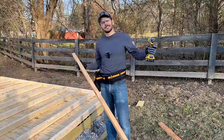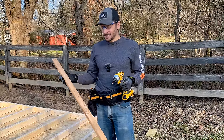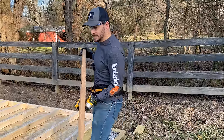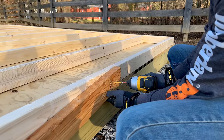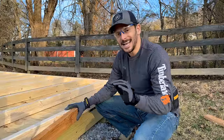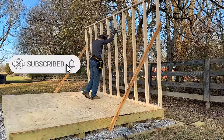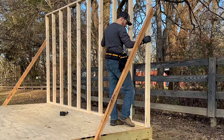I'm going to stand up the back wall now. Since I'm by myself — my lovely wife Susan is filming — I'll show you how you can do this alone. You can use a little helper beam: lay it out here and screw it into the side so this little screw acts as a hinge. When you raise the wall up, this little arm comes up and helps support it, and then you can attach the wall onto the foundation. There we go — I'm just going to square this up on the back wall.